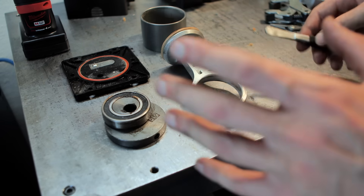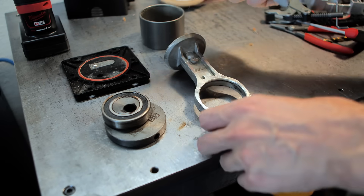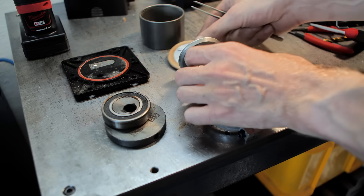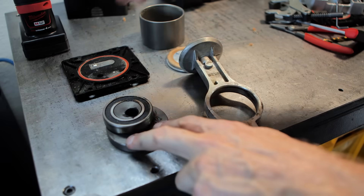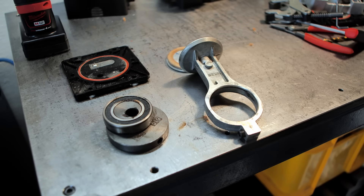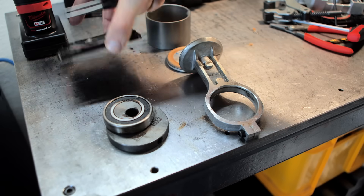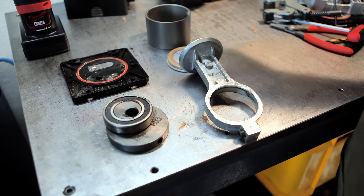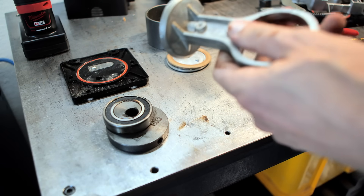These are the essential parts of the compressor. We have the connecting rod with the piston as one casting, plus a keeper plate that holds the seal in place. We have the crankshaft with the crank bearing. The cylinder is just a piece of aluminium pipe that's been turned on the inside and hard anodized. The plate — it's not plastic, it's some light alloy, aluminium or magnesium. And the valves — that's all there is to this compressor, and it worked for 10 years.